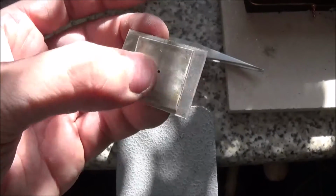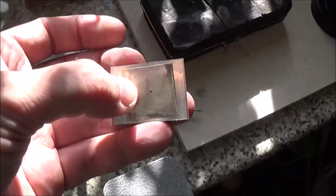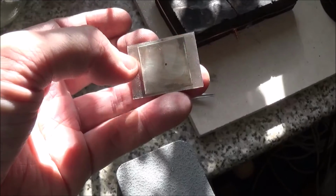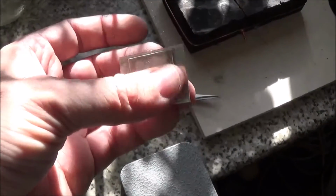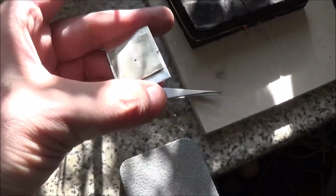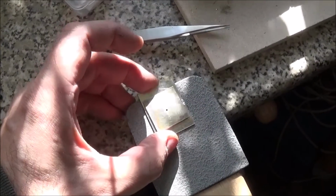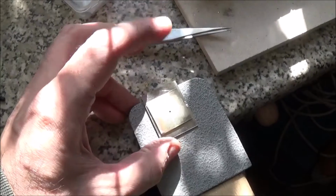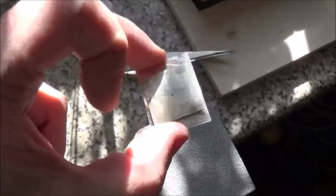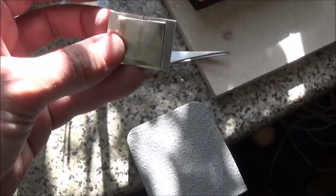The buffing process might be useful because maybe this material is slightly thick. It's 0.5mm, and the standard dial thickness, I'm told, is 0.4 millimeters. So a bit of buffing on the front won't hurt that. And then that is going to sit on top of a 0.5mm thick material, and with a 2mm thick material on the top. That's going to be the piece which slides in and out of the 18 karat case that I'm going to make.